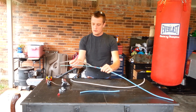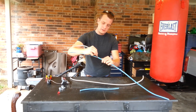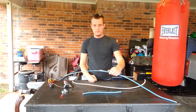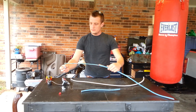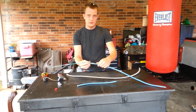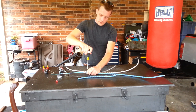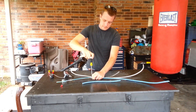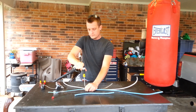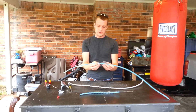Once you've done that, you take the plastic insulation and you're going to fold it over. You center the insulation into the center point where you stripped the cable — it looks something like that. Once you have that, you take your connector, take the set screw, and line it up with the center again. It slides right over. Then you take your screwdriver and tighten it down. And that's the proper way to strip MC cable. Now it's ready to be landed into a box.